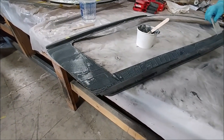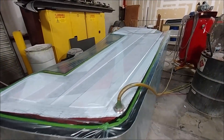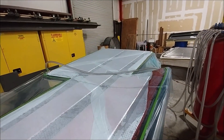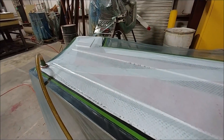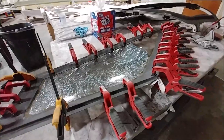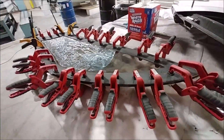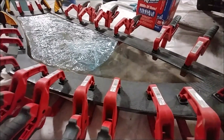Unfortunately you don't get to see all the sanding and prepping that goes in before actually bonding something. Here's that lower wing skin — the first round of that one under the bag — so that'll get the peel ply and stuff removed and have the last layer put on it later on. And there's the window bonded into the frame with just a couple of clamps on there to hold it down nicely, getting a really tight fit.